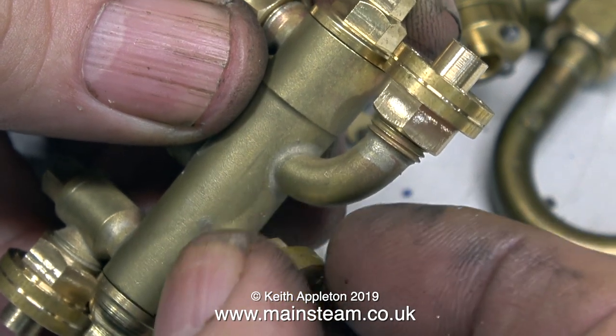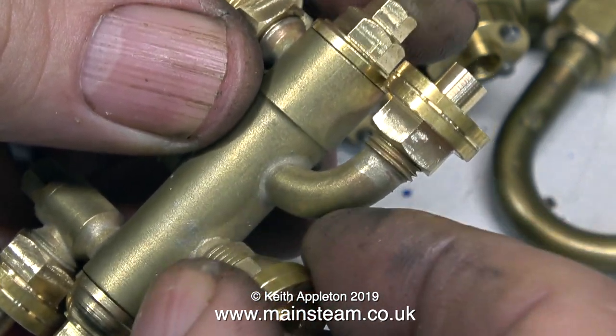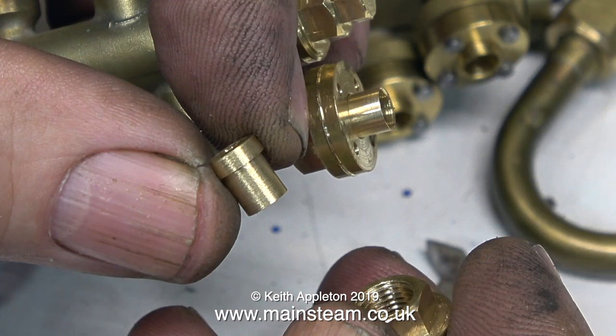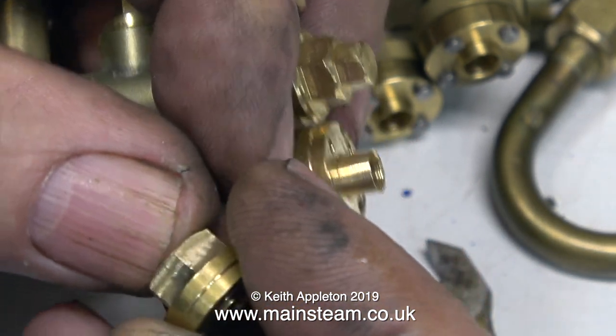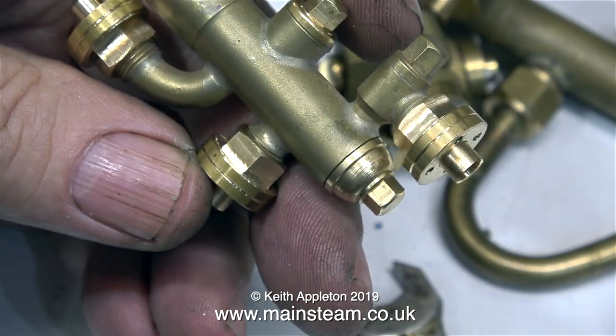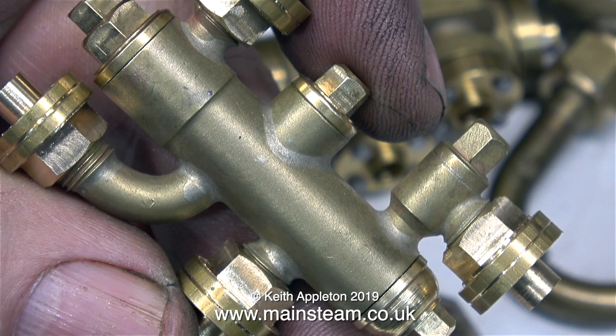I'm going to thread the holes to take some 10BA hexagon bolts. They're left blank so that the user can decide what kind of bolts they need, relative to the scale of the engine the injectors are fitted to. In this clip you can see that all they are is standard flat-ended steam unions, making it very quick and painless to remove and refit the injector. I think this is a really good compromise between practicality and scale appearance. I once watched John Hallroyd at the steam workshop dismantling the water system from a 5-inch gauge 9F steam locomotive, and it took him a long time — every one of the flanges was bolted together. I really do admire his skill and patience, but I prefer a much quicker method.